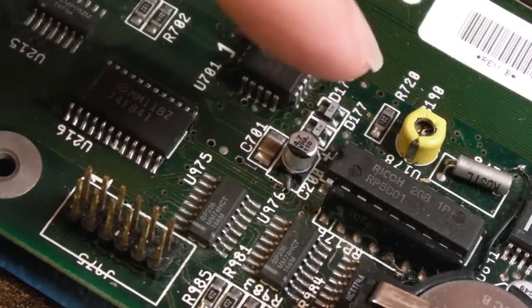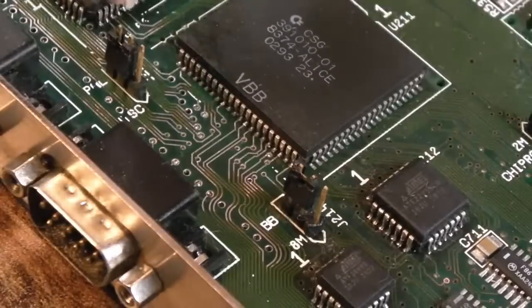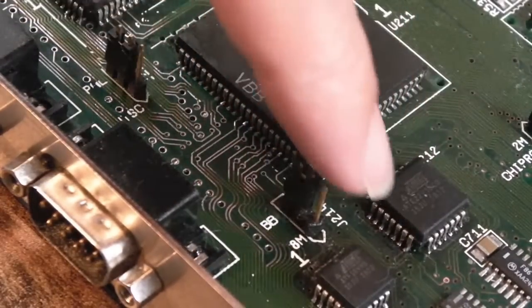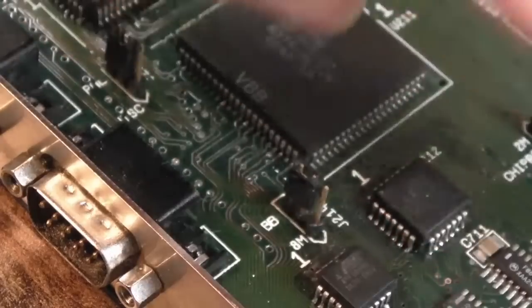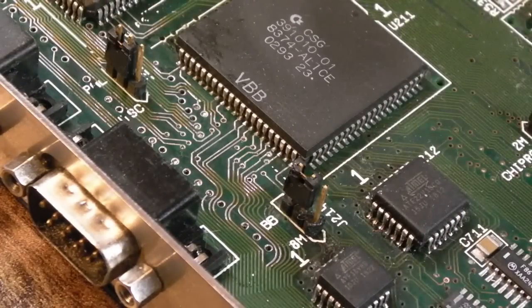And I think there's a real-time clock issue still with us, so I'll need to remove the battery, but I'll do that later. At this stage, I just want to keep working this way here, deal with wires and things around these gals, reflow. You can see that looks pretty crusty. Reflow around there, reflow these two, swap that cap out, and then have a bit of clean and scrub around here and see how it's looking at that point.